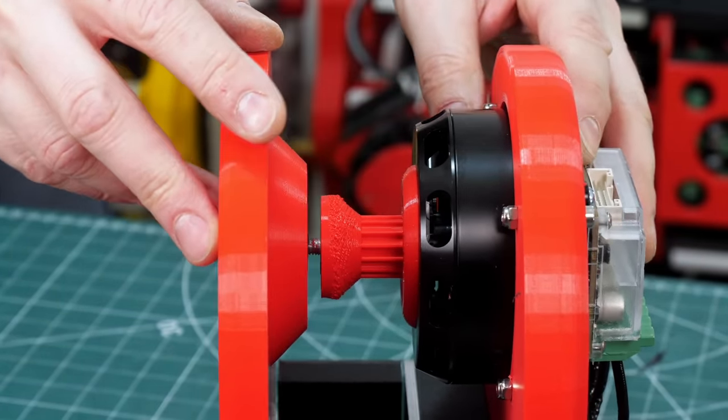All my actuators plug into these connectors that were provided, and I'm using XLRs to daisy chain the CAN bus between all of the O drives. I just have to remember to keep all of those connectors high up and zip tie them up or something so they're out of the water. So that's CAN bus and ground going into each of the O drives, and that grey cable is a shielded cable, so we shouldn't have any problems with interference.